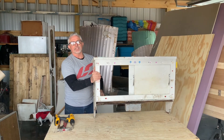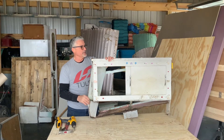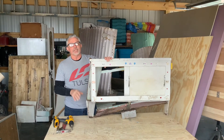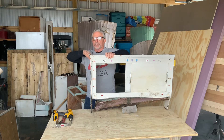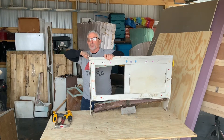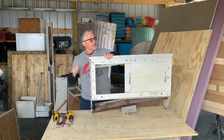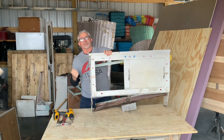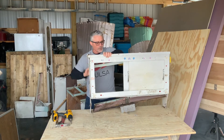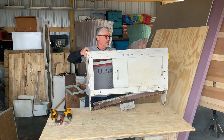This is the upper cabinet that goes above that — not so much. This one is a complete rebuild; we're going to have to make templates off of it and rebuild it 100%. I'm going to come off the sides here, extend to the back of the camper, and build another shelf that curves across to brace into the wall — tighten up the camper even more and give a little extra storage. I'll keep the original hardware, but that's the only thing I'm saving on this upper cabinet.